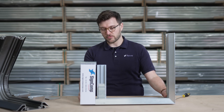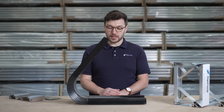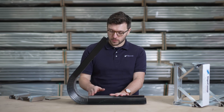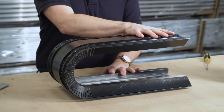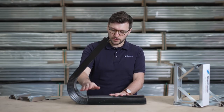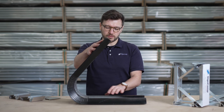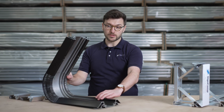That's how you build a rectangular or square box. And finally, I'm going to talk to you about bending. Using the principle of curve cutting or slotting the aluminium, you can create curves like so. The more slots you put in, the tighter the radius you can achieve. This is perfect for creating different shapes or needing to match branding guidelines or logo designs.